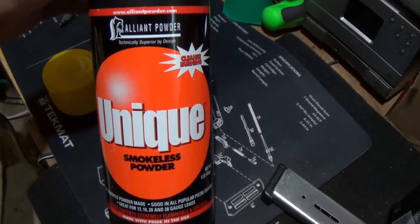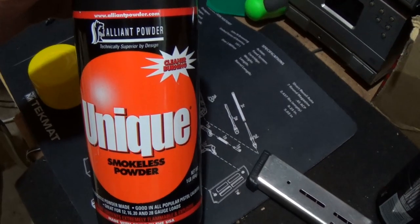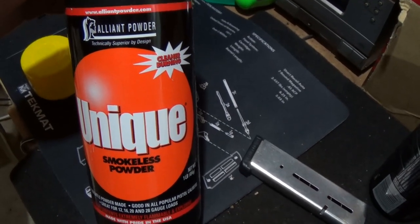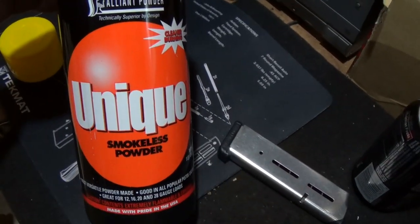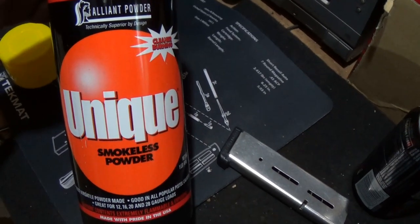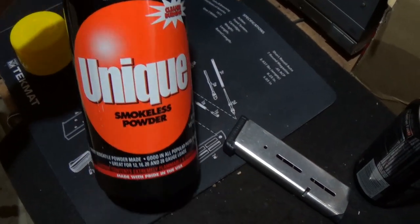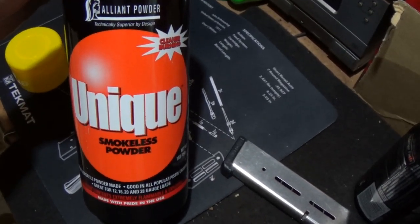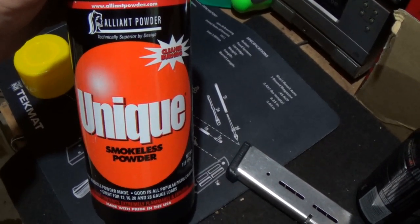Today I'm going to use Alliant Unique powder to reload my 45 ACP. My last batch of 100 I loaded up to 6.5 grains of Unique, which was the max charge in the Lee book - those were too hot. Out of 50 cases I shot, seven were split. There was also a couple where the ejector was making a mark in each case, so they were a little over-pressured. We're going to drop the charge down to 6 grains even of Unique. We'll load about four right now, test them, make sure the gun cycles okay, then come back and load the rest with 6 grains.